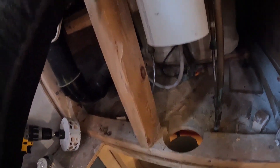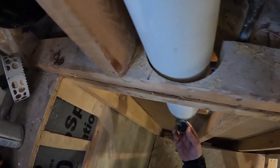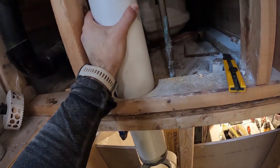I was way over 200 — easily 250, almost 300. So I purchased a fan designed for a radon system. What you're trying to do is suck all the gas from under your slab before it permeates through cracks into your house, where it gets trapped mostly in the basement due to less air circulation. It's very simple: you dig a hole in your slab, put a pipe in, seal it up, route that pipe up through your attic and roof like a plumbing vent, attach a fan made to run 24/7, and it vacuums everything from under the slab and exhausts it out before radon can enter your house.